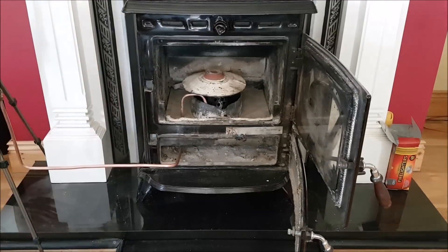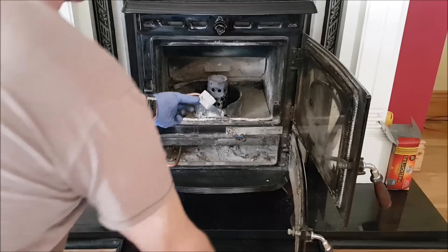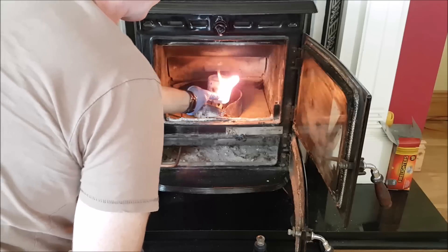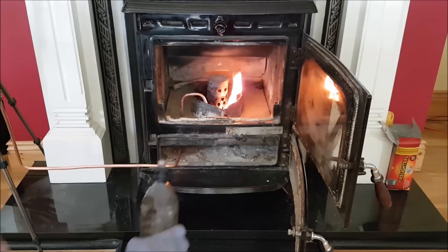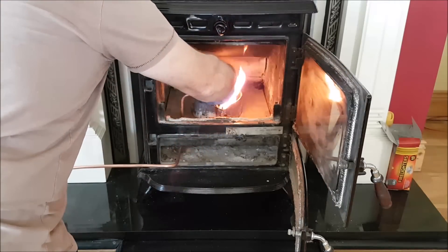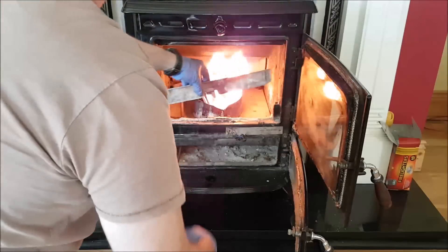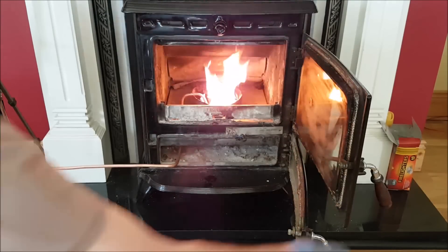You can see the oil line is in one piece — there are no joints on it. I'm going to light it now. Here we have a fire lighter — throw it in, light it, throw it in. There's a great draw on this stove; you can see the flame being sucked into it. I have eight metres of flue between here and the chimney — it's block construction with a flue liner. I'm adding some kerosene just to get this going quicker. This has never been tried in this house before and this is probably the only time.